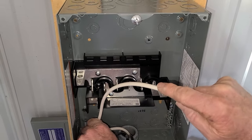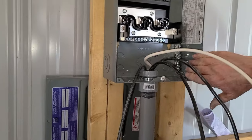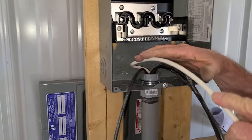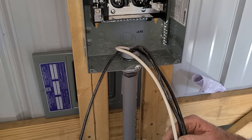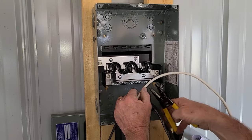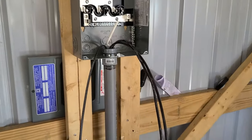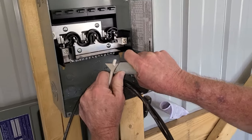And then the voltage tester. First thing we're going to do: cut the wire to a particular length, strip it back, and slip it into one of these holes here. The ground is number 8 gauge and all the others are number 6. You are allowed to have your neutral be the next size down from your primary hot wires, but I chose to make them all the same size. We'll cut the white wire first — I always like to leave just a little slack in case I have to move it around. If you watched the wire pull video, that's why we have about six feet of extra wire coming out of the LB — it's better to have too much.